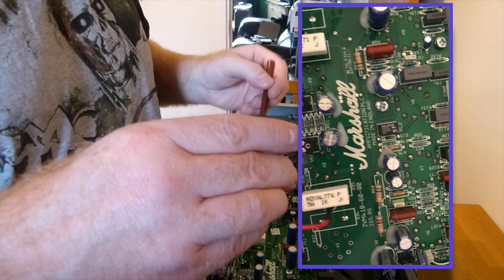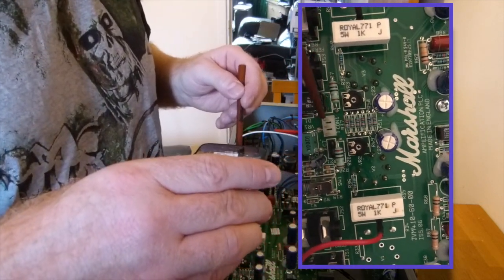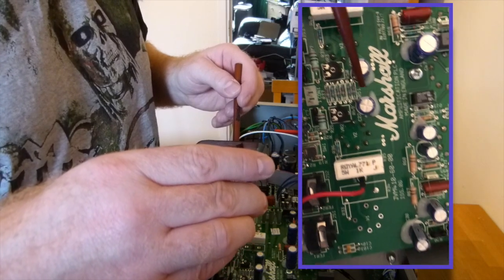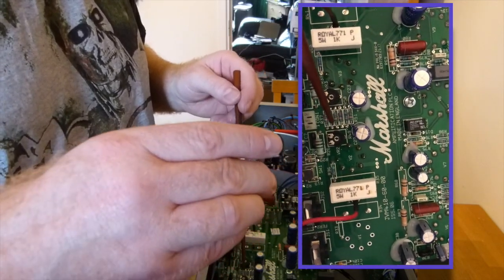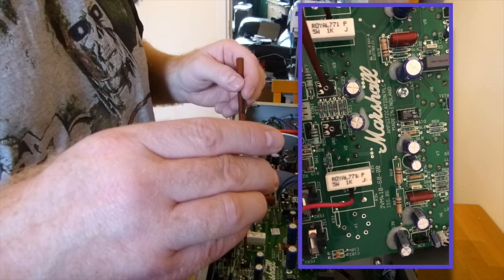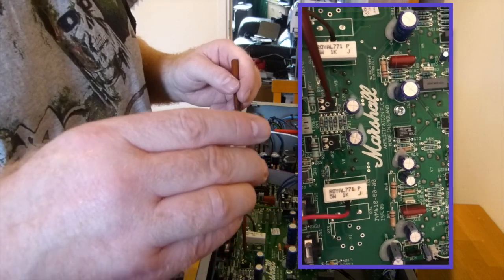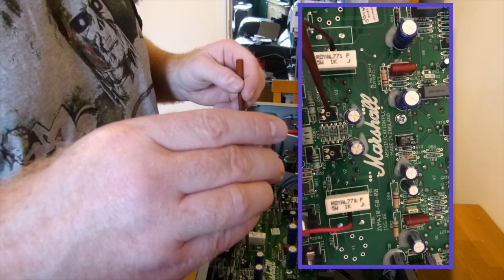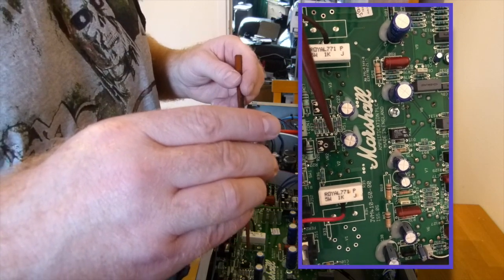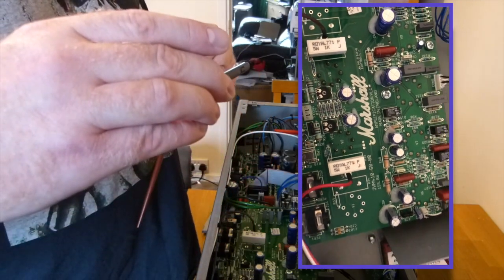And just down here, CON1, connector 1. That's where we're going to be connecting our multimeter to take bias readings. And then there's the two pots. Adjust the bias reading so that we get them as close as possible and at the right reading. So we're aiming around 30 millivolts, milliamps, which we'll read off of our multimeter. And that's pretty much it.